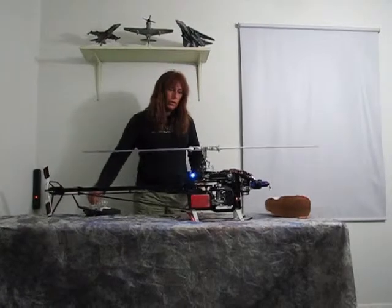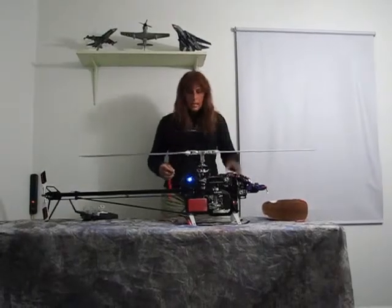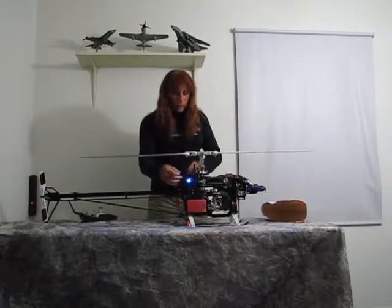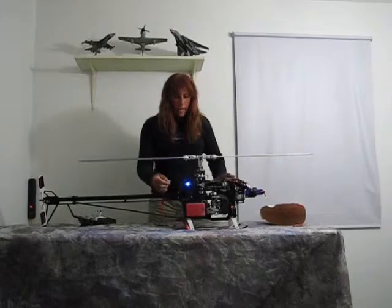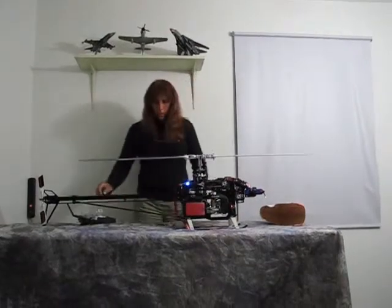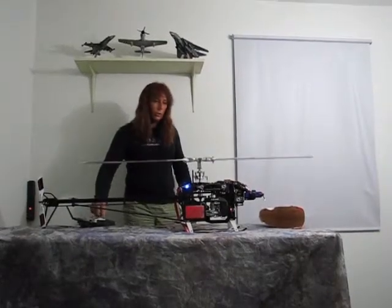I've got full control of my helicopter. Now my BEC fails — watch this. When I turn off the BEC, it's going to stay on because when the backup guard detects it's not getting power anymore, it sends power to it just that fast. Look at that — I turned it off, the backup guard took over, and I still have full control of my helicopter.